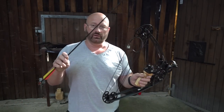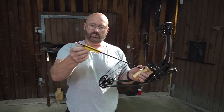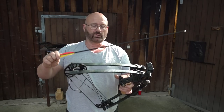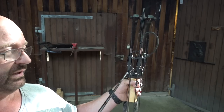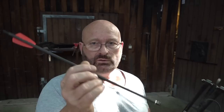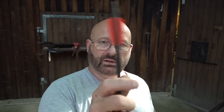First of all, you have to settle on a certain arrow type, and you have to use arrows with just two vanes. So if you have a three-vaned arrow, you have to remove two of them and re-glue them so that they are flat. You also need to set the sight on the length. A long arrow won't work for this bow, since it has two pulley systems that make it impossible for arrows to be fed from either side. I settled for the 15-inch arrows that you can buy for the Cobra R9 and R10 system. I like those because they already have two vanes only, so there is no work to be done on those, except maybe trimming down the vanes a little so you can build a flatter magazine.